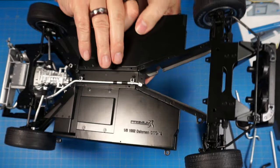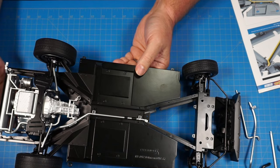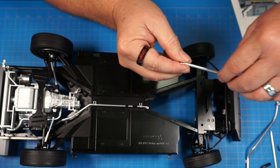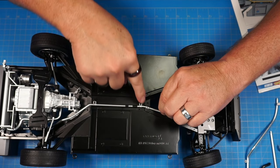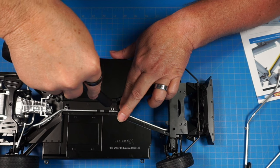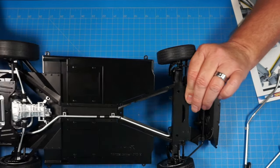I'm going to be flipping this back and forth, so we're going to go back this way again. I want to set it up so it's not on the motor — let's set it over like this. Now we've got part 30c, this pipe here, and that's going to be going underneath here and connecting onto this one. We'll screw that on with an AP screw. Let's get that screwed in, then we'll flip it over and make sure the other side's in right.